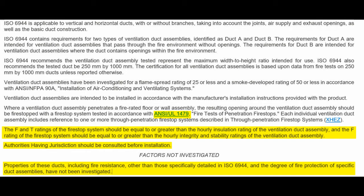And you need to think about the exact purpose on the construction site. If you're going to use this, how would you get with the fire prevention officers afterwards who are responsible for the turf that this occupancy is on to say, listen, you better get in there and make sure that they don't move any items too close to this ductwork, because if it gets within 18 inches of it, then it's outside the listing and bad things may happen. Right? You need to think about those things. What's the likelihood of that afterwards, right? So, I mean, theoretically, you could put signs everywhere. You know, or don't get too close with anything, right?